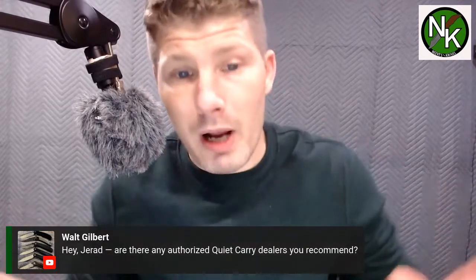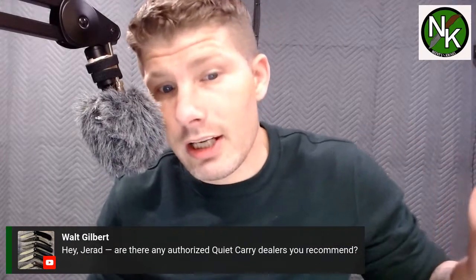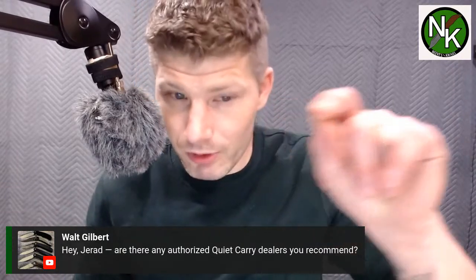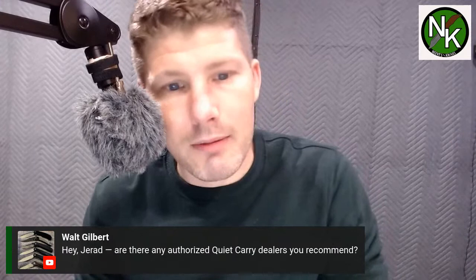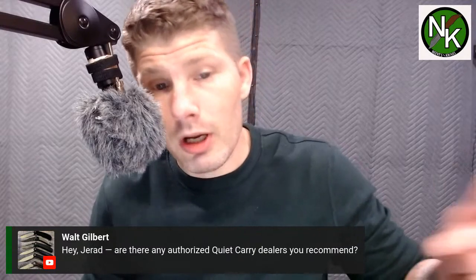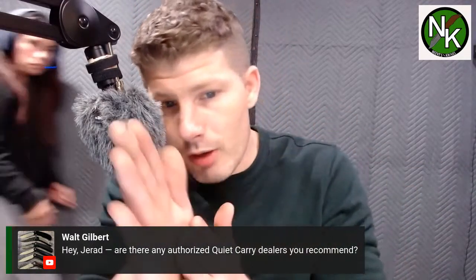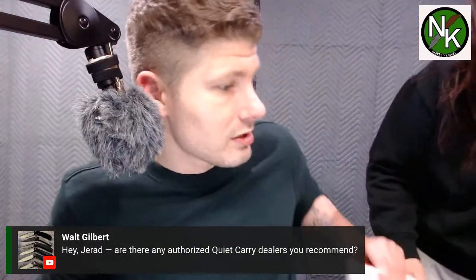And so I do a mirror polished edge. Then I drop down to a 600 grit edge and lay just like a grit pattern over the polished. You can actually see at the top of the bevel is still polished. And for whatever reason, man, it makes the edge so damn sharp. Now it looks like a toothy finish, so it's not polished anymore. However, microscopically in between each grit pattern, it's like still polished. So it carries its bite.